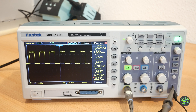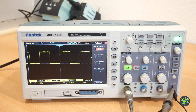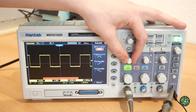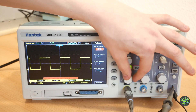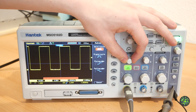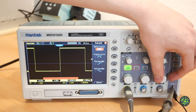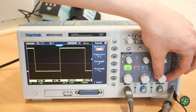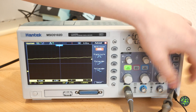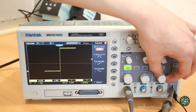So there we see the test signal. Because I am lazy I will press the auto set button and the scope will try to find the best way to display the signal. But we can also center it manually and decrease the volts per division to get a better view of this signal. We can also zoom in horizontally by changing the time per division to up to 8 ns, but as you can see this is far too fast for the signal. Let me zoom out again and we can take a look at some other signals like the ones my component tester can generate.